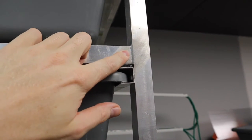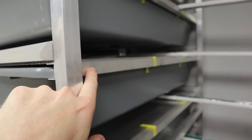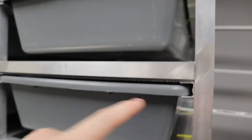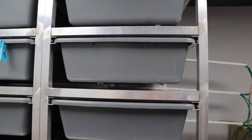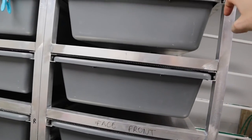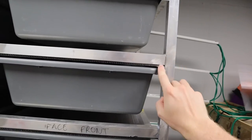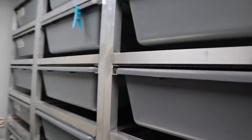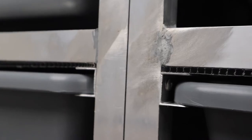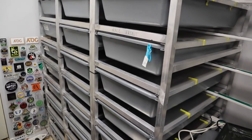These brazed joints basically held the frame together while I did everything else. The main structural element is actually these bits with the rivets and the runners — the runners go all the way from front to back, and that's what stops the rack from falling apart. The rack could potentially split apart sideways if forced, but with all these joints going down I think there's enough strength. The majority of the weight pushes downwards, so the runners and rivets are what hold it all together.